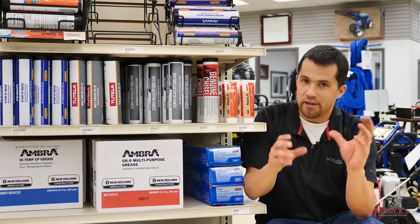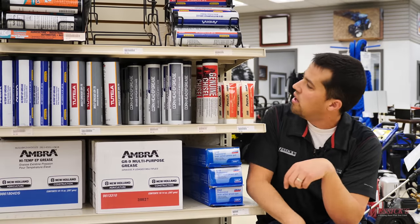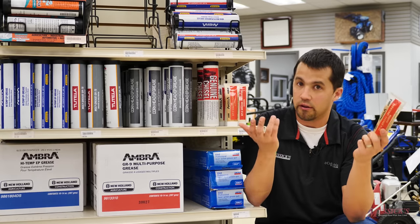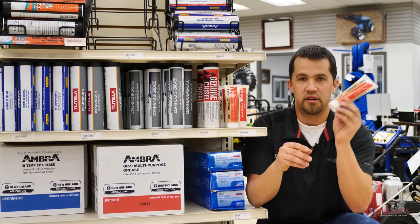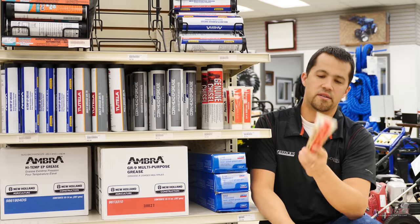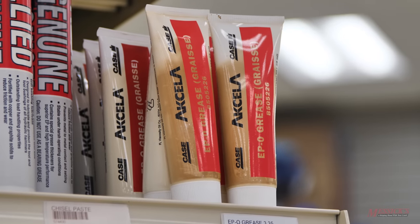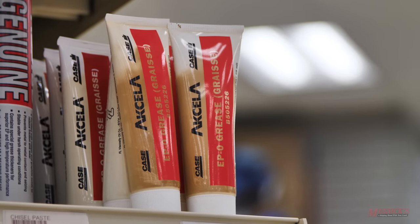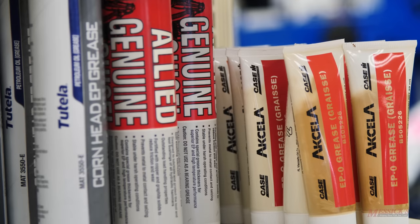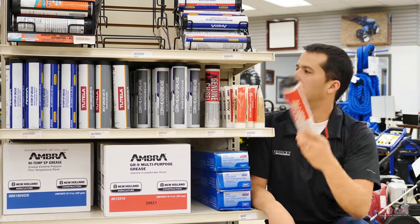You can classify greases into your typical tubes that go into regular grease guns for maintaining equipment, but then also some specialty greases. We don't always know the formulations of every one of these, but there are certain ones made for particular gearboxes and applications that may have some different mixes. This one right here, when we look inside of it, it almost looks like a gear oil — it's a grease, but it has the smell and look of a gear oil. There are also high-impact greases made specifically for construction hammers where the grease is being pounded upon, formulated to stick together — really for specialty applications.